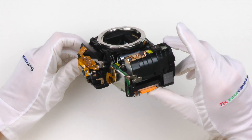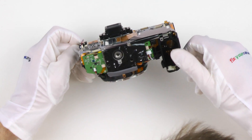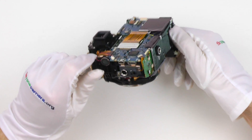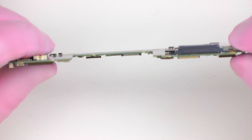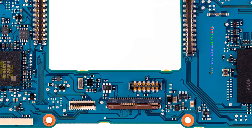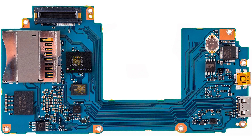That's how the Canon 6D looks like without covers — nothing unusual, looks quite good so far. The main board: the only thing I don't like about these U-shaped boards is that they are very delicate at the junction point. On the other hand, there are only connectors located on this very flexible part — no major components close to it like BGA chips. BGA chips are not flexible at all, so over time they could separate from the board. It shouldn't be a problem here.